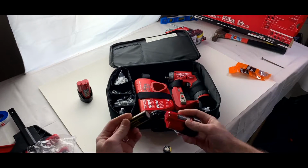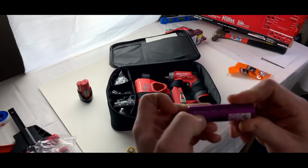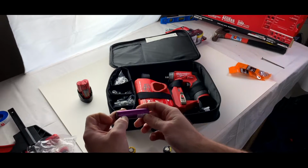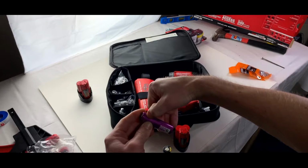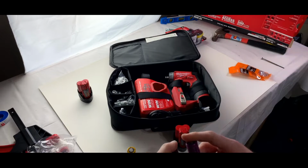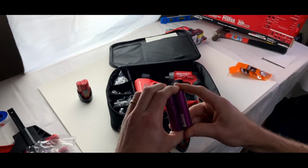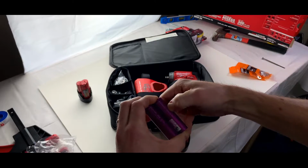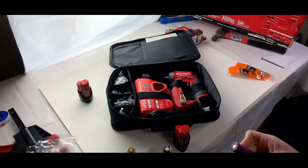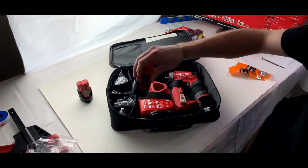But hey, whatever it is, they got 2 amp hours out of it. Because on this one alone is 3. It's really hard to see. I'm sorry, guys. This is a 3,000 milliamp hour, so if we just subtract all the ends there, this is a 3 amp hour singular battery. Now, what I would think is that they're going to run them all in parallel. And since it's going to be a high torque tool, they're going to have to run high amperage. So each battery allows up to 35 amps. It's a total lie. I think it's a 20 amp continuous. Yep, we've got 20 amp continuous. So they might be using something similar to this. Probably not identical, just because this is a different application.